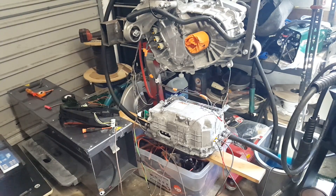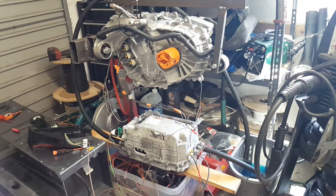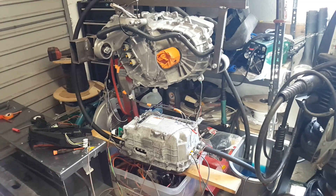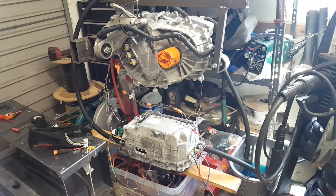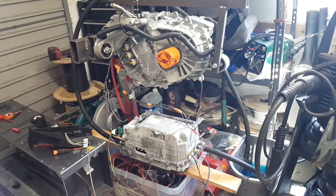So that's the story folks. I'm not sure if that's a world first, a Damien first, or a nobody first — but we have closed loop control on this drive unit now. I'd like to particularly thank the people that responded in the comments section to the last video, because learning that it's a six pole motor with a three pole resolver was pretty much the making of this thing.